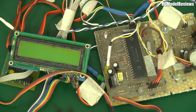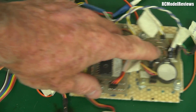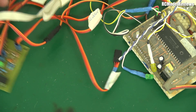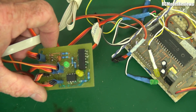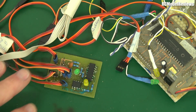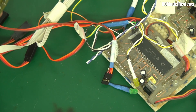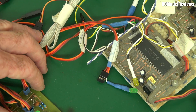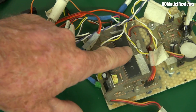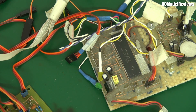I could upload a flight plan from a computer directly onto this chip. That was it — that was the brains behind my low-cost cruise missile. The component count is incredibly small: one large processor, a voltage regulator and some resistors, and a couple of integrated circuits on the switcher board. Once the flight controller was debugged, you didn't need to switch back to the RC system at all — you just input the waypoints into the processor, flick the start switch, and away it went to wherever you had programmed.